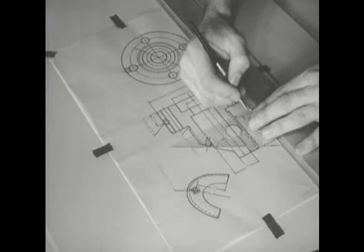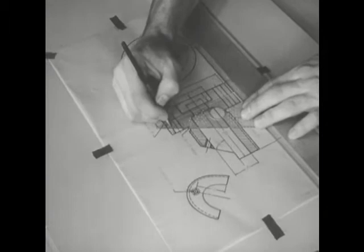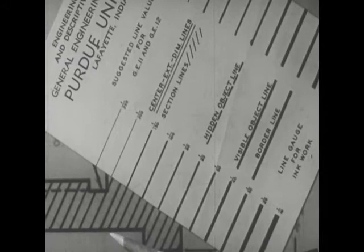If a section line is separated into segments by holes on the cutting plane, the segments of the line are traced with a single setting of the triangle. Section lines are 1/150th of an inch wide.